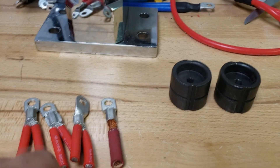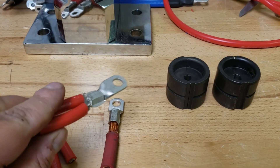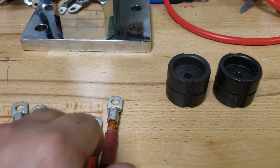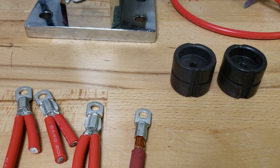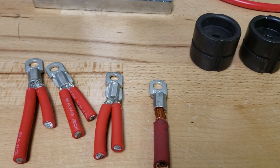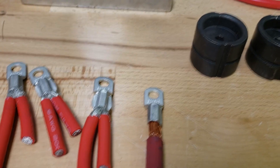In the last video we used something like this, where it was a slightly undersized die. The reason for that is because two 6 gauge cables are not exactly the same material as a single 2 gauge, so normally you can get away with close enough, but we went with 2 gauge because the material in it is slightly different.